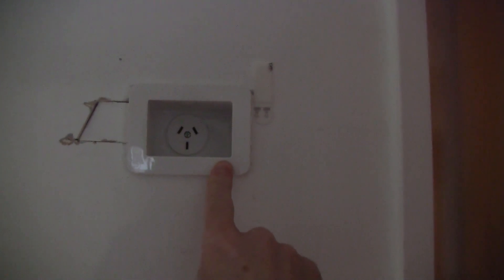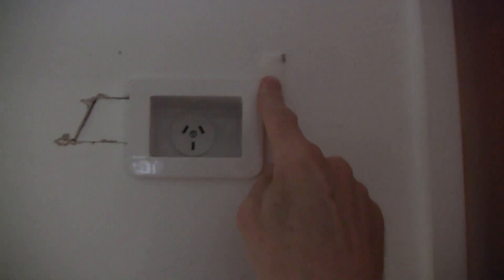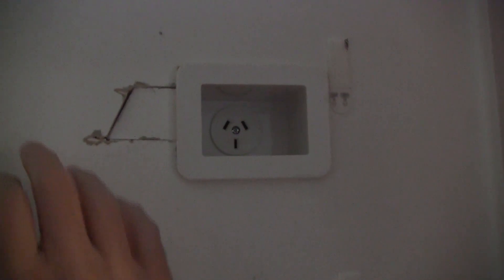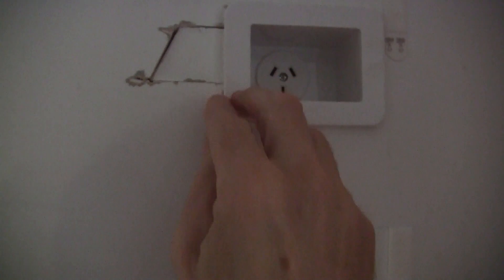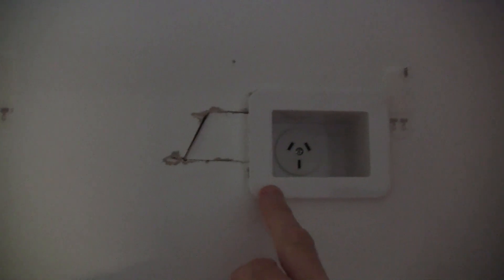Here we are with the tablet removed. I've got a recessed power socket mounted in the wall — mains coming up, tapped off from a main socket in the ceiling. I've got the 3M picture frame hooks there, which are like a Velcro-based system. When I went to cut the hole, I did put a stud finder on there, but I didn't realise there's a plastic pipe running down the wall which I just about cut through. So use a better stud finder than the one I used — one that can find plastic pipes.